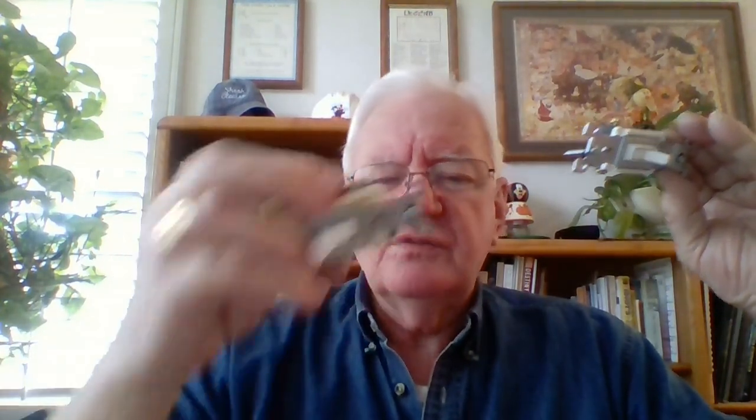Three-ways can only be joined by a four-way. Three-ways are at each end of the circuit, and if you have a third switch location in the middle, it has to be a four-way.